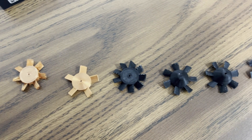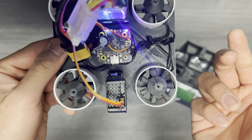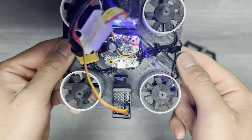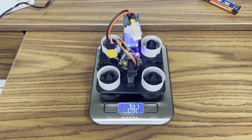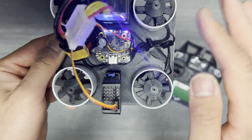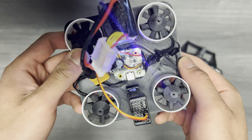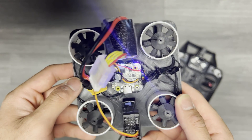This was after a good five or six tries of propellers that didn't even work. So I used a kitchen scale to test thrust. I subtracted the amount of mass removed when the drone was at 33 percent throttle from the mass of the drone at the beginning. I got about four grams of thrust, which is about 1.5 percent of what I need to hover. So clearly I'm a long, long way off. I am accelerating air though, just not nearly enough to get off the ground.